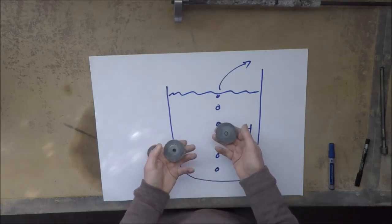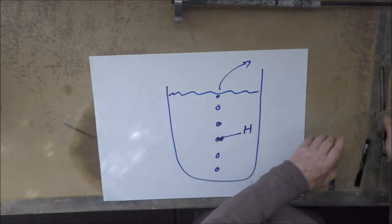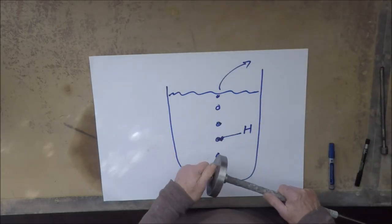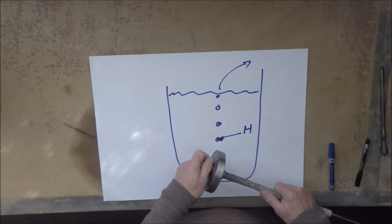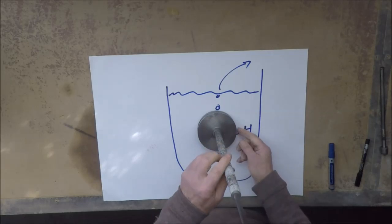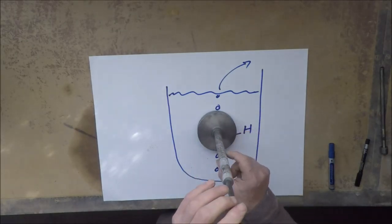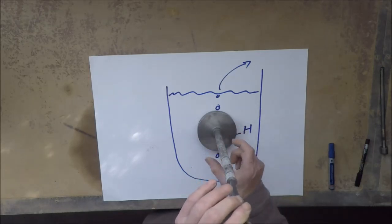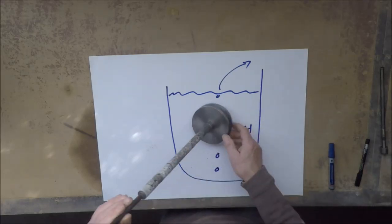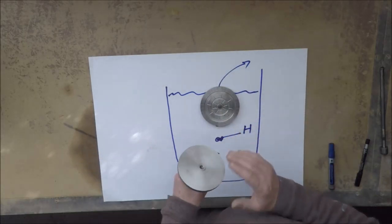I've made various sizes over the years. Here's a slightly bigger one that's done quite a lot of use and is now quite badly oxidized, so it's time it was replaced. This time I thought I'd make something a little bigger — and this is it. I've decided to go bigger because there's a tendency for the gas to come in toward the central column, so you wind up with bubbles only coming up in the central area rather than right across the whole melt.